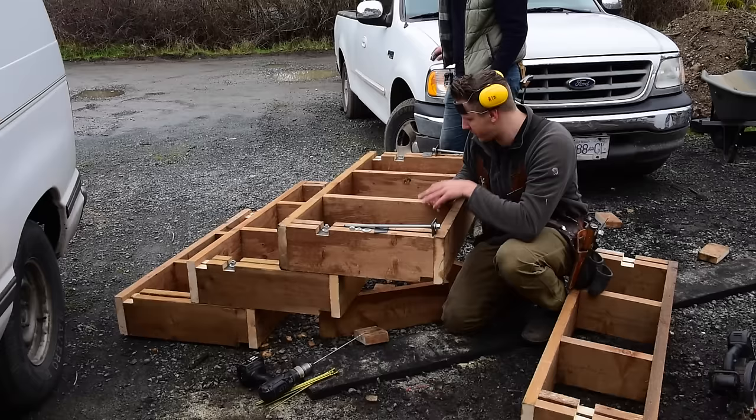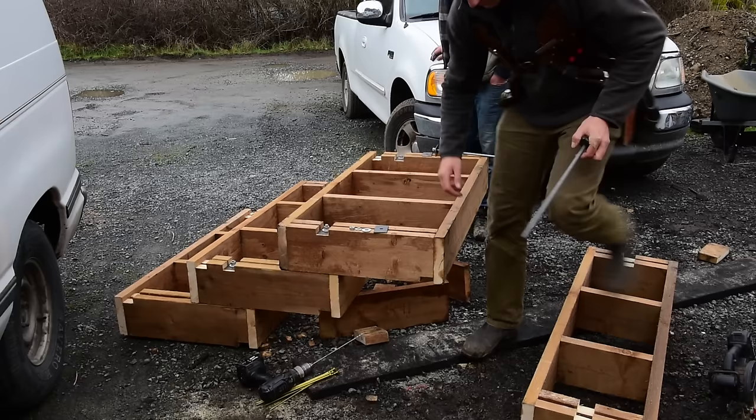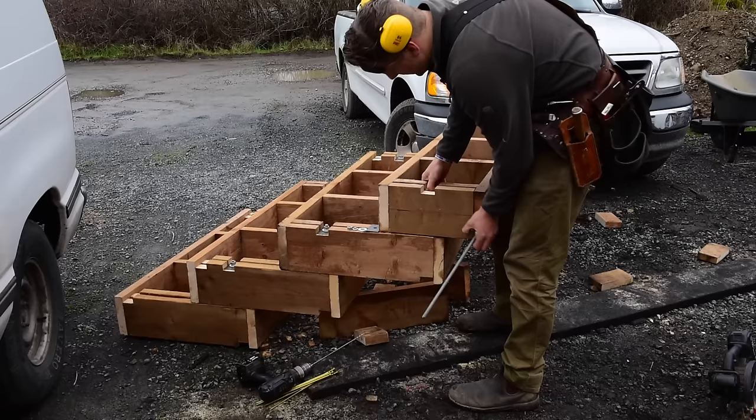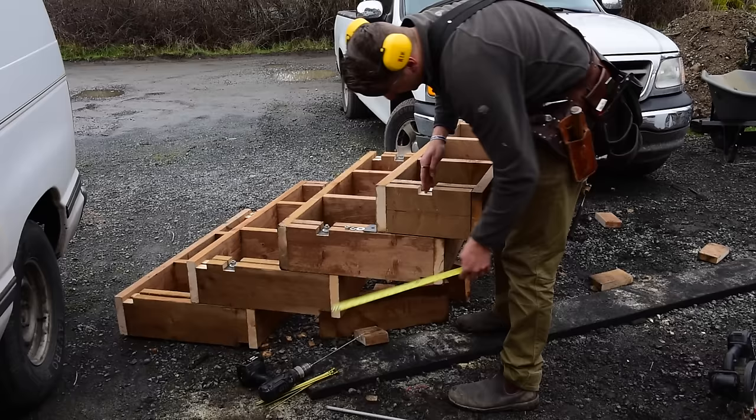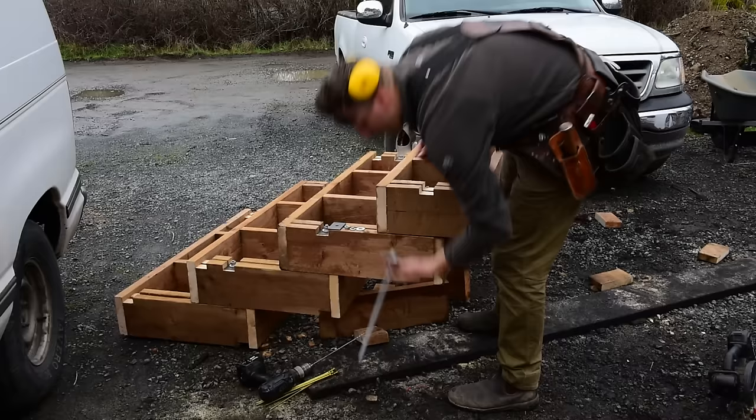We'll just block it up and give it a test jump a few times to see how solid it is — it seems rock solid. Here's what we're doing: watch and learn. We've got these boxes set up. I wanted a 16-inch stair tread, so I just mark my 16 inches where I want the overlap, then we've cut these notches plumb with each other.